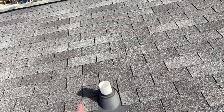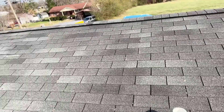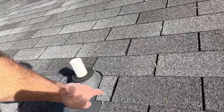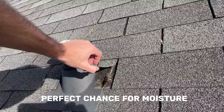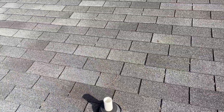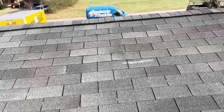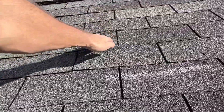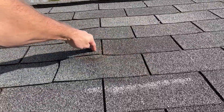The wood is bad. It would be a lot softer if we were wet. We've been unusually dry in Tennessee right now. This one's not particularly tight. I don't like seeing that. I don't like seeing avenues for water to infiltrate the system. That pipe boot flashing should be redone as well. Right here, because they installed it so quick, the shingles were butted up too close, and now they're bridging.